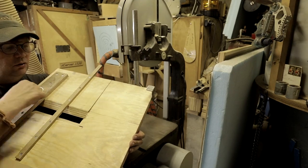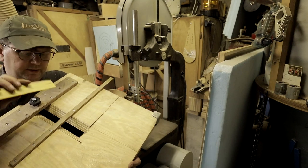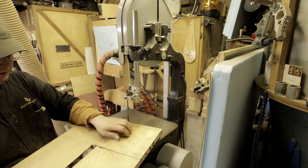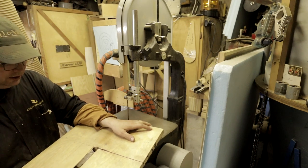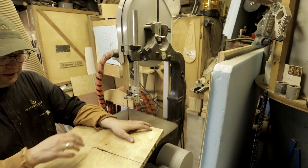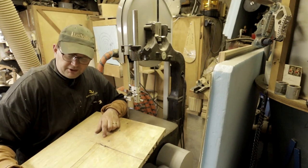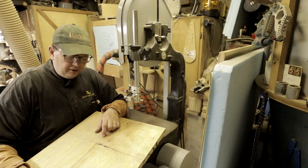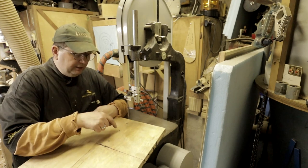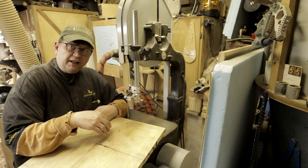What I ended up doing was cutting all the way from here all the way back, then I took this piece and stuck it in there and trimmed it off. Of course now this is going to be two different thicknesses because you're losing two curves on one side and only one curve on the other side. So on the other side I trimmed it until when you put these two together I got a fairly nice snug fit — not super snug, but snug enough. Then I glued it back, put some pin nails in to hold it initially while I clamped it, and then put three screws in here. So this is now one piece again — that's how I get that second cut.